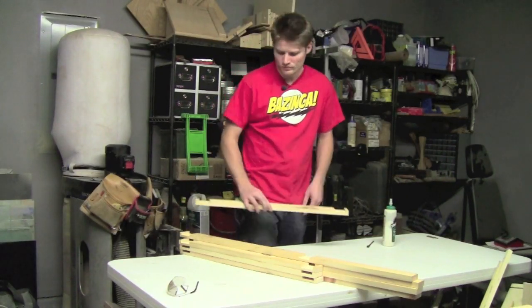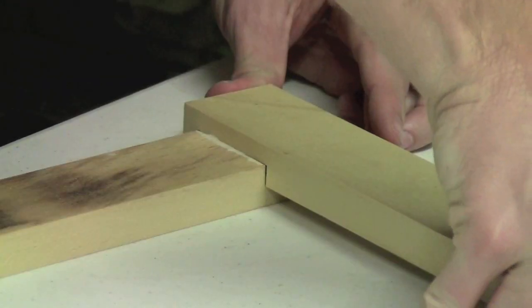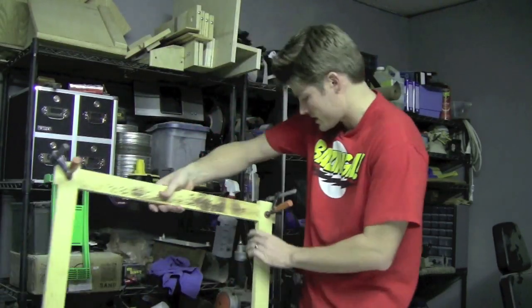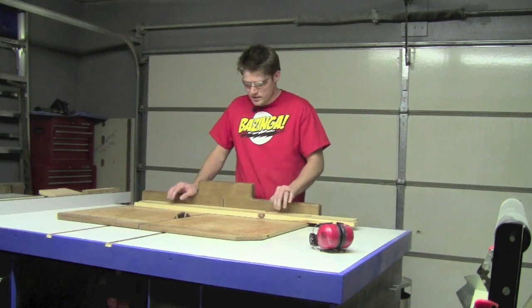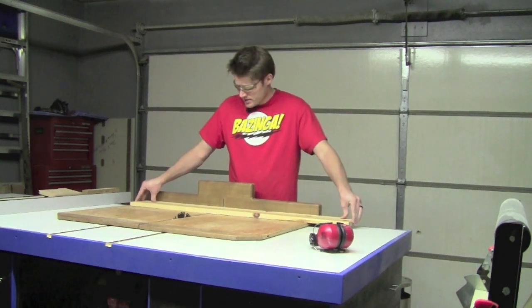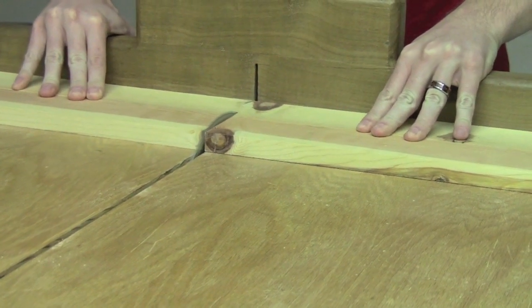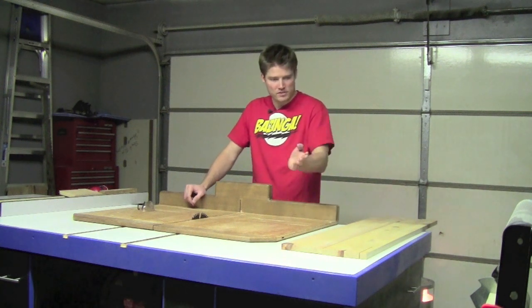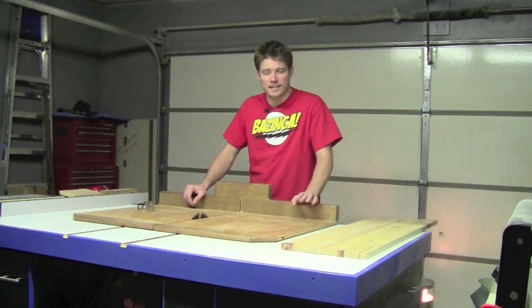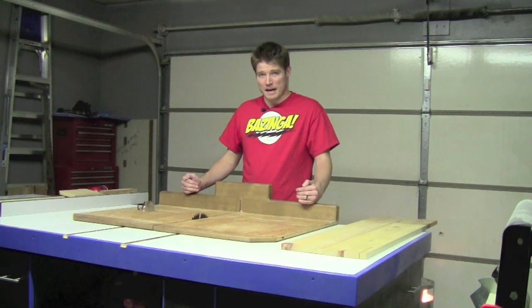Now it's just time for a little bit of assembly. We're going to set that aside to dry and then assemble the other one. Now the tray sides - according to Mark's design that he put together as well as Mere Mortals - I'm going to leave mine the same as theirs and it is 27 and 5 eighths. Now we're going to do the fronts and backs of each tray. We're going to have to square off the ends and just make sure that we don't get any nasty knots on the ends, simply because we're going to do half blind dovetails in the front and then sliding dovetails in the back instead of a dado.